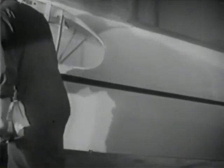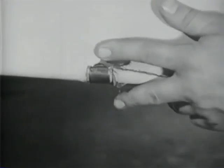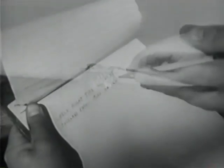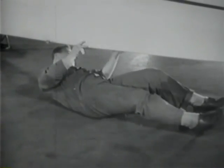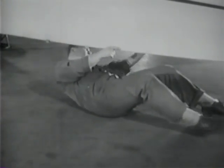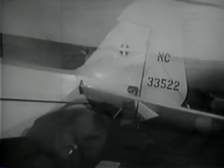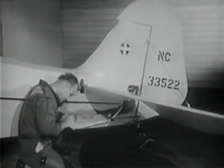Continue your inspection by checking the covering of the fuselage. The small hole could wait for periodic inspection for repairs — make a note to check it next pre-flight inspection, as it may get larger. Fuselage covering gets its worst treatment underneath. Clean it, inspect it, and you're ready to check the inspection form to see what must be examined on the tail surfaces.